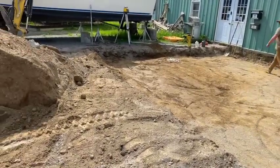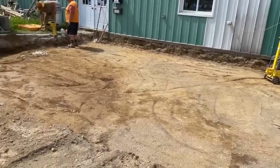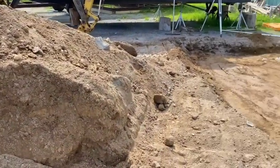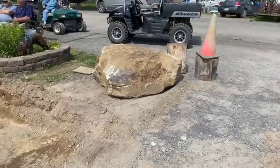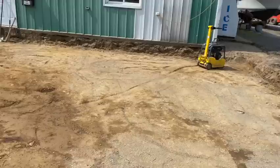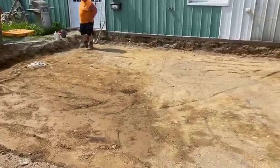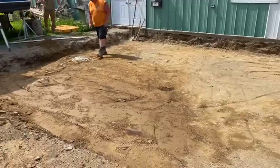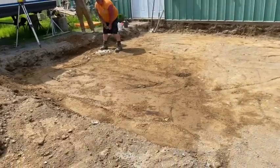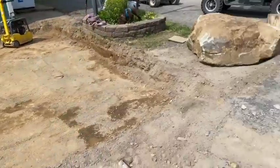Okay guys, we are doing a little monolithic slab. It is 23 by 16 right here. We just dug out a bunch of this material — kind of a sandy gravelly mix. We took out this huge stone right here, as you've probably seen in the first part of the video. And Big Biscuit just tamped it all. That stone was like right here. We packed that big hole in. I got a load of what's called item four gravel — it's a three inch minus crushed gravel. I'm going to dump like half of it in here and the other half over there.